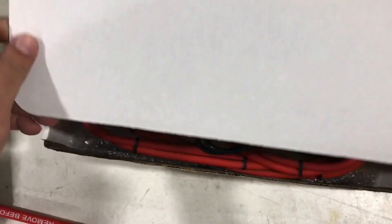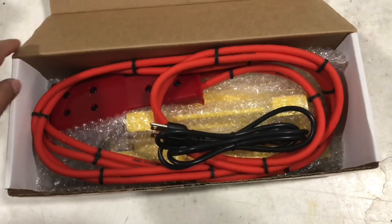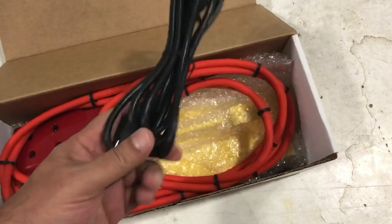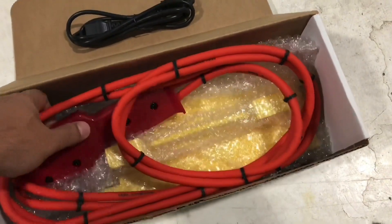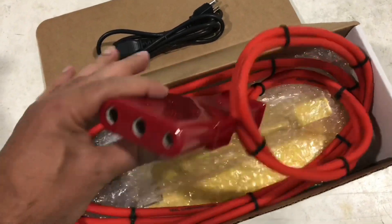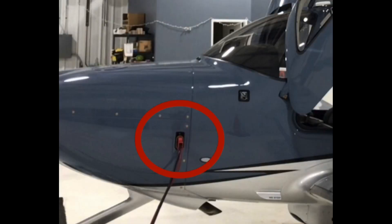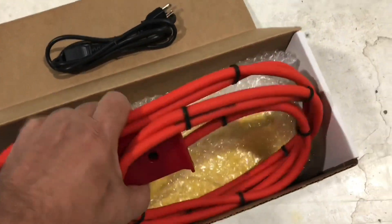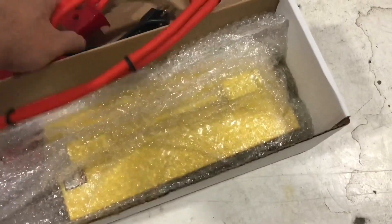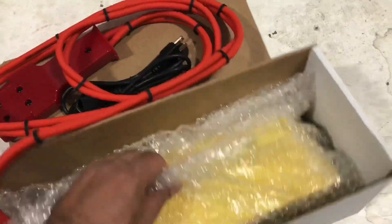In this box you have a start pack — it's a power supply that puts out 24 volts to simulate the same voltage as when your aircraft is running under power. It plugs into the side of the cowling and it's great for having the airplane turned on without wasting your batteries, so you can do work in front of the avionics.